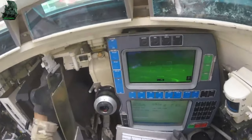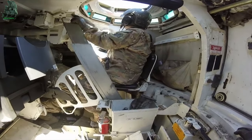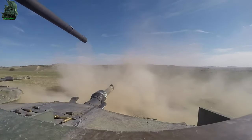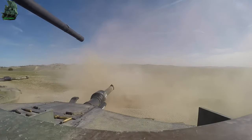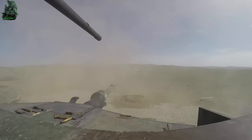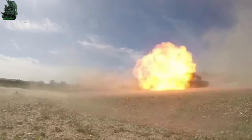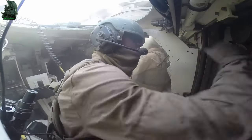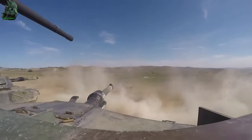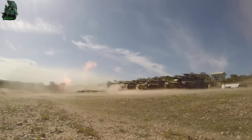The Abrams is equipped with a ballistic fire control computer that uses user and system-supplied data from a variety of sources to compute, display, and incorporate the three components of a ballistic solution: lead angle, ammunition type, and range to target, to accurately fire the main gun. These components are determined using a laser rangefinder, crosswind sensor, a pendulum static cant sensor, data concerning performance and flight characteristics of each round, tank-specific boresight alignment data, ammunition temperature, air temperature, barometric pressure, a muzzle reference system that compensates for barrel drop and barrel heating due to firing or sunlight, and target speed determined by tracking rate tachometers and the gunner's or commander's control handles.